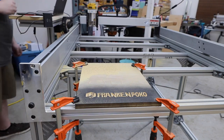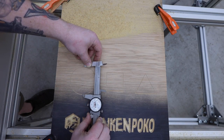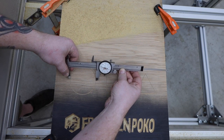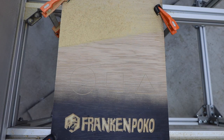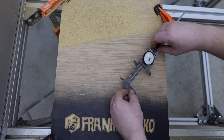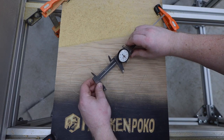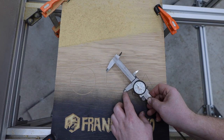Next, I cut a square, circle, and triangle so I can do some quick checks. I used a V-bit here because it was already in the machine, but you can get a more accurate measurement by using an end mill and cutting either inside or outside of the lines. Not only can you measure each piece to make sure the circle is round, square is square, and each side of the triangle is the same, but you can also make sure they're measuring true. I plan on doing a full video going into more depth about these and other ways to check your machine.